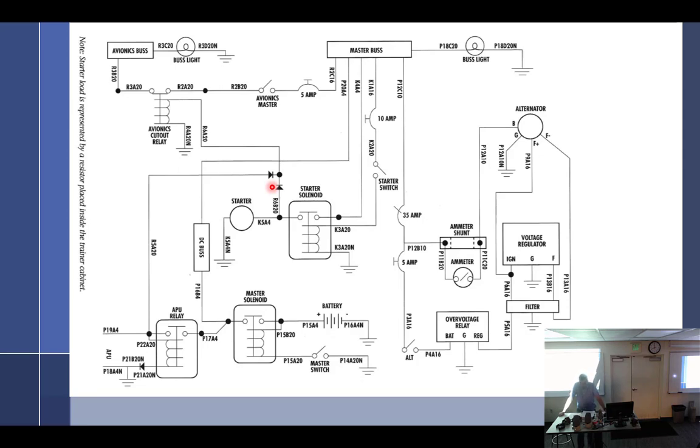When you get down to doing your project in the lab, the alternator you use is going to have battery, ground, stator, and field. So stator in this case would be the F positive if we're looking at this one, for example. F plus would be our stator. I'm hesitant to say yes. I believe so, but I don't want to say something that's wrong just to try and look like I know everything.